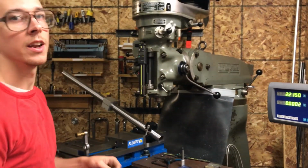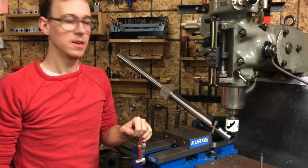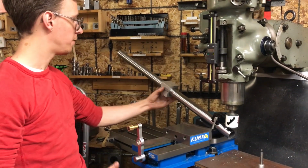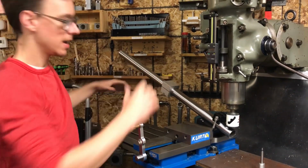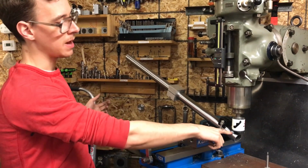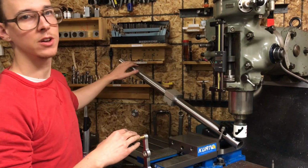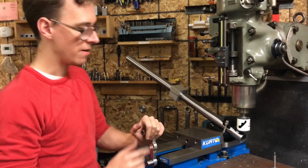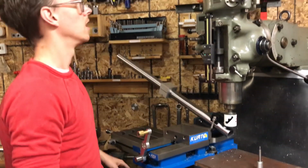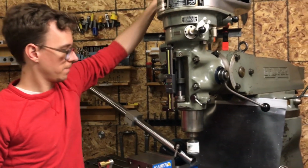We'll see if it gives us the right fit, but we'll start here and try it out. So I'm on the tube center line. I set the angle. I phase the tube this way, and I'm ready to make a cut. I'm up to my mark here. This first cut is not so critical on the length because I'm going to set the other cut according to the first one. My vise is tight. Well, now it is. And my table is locked down. That's what these are. So I'll take a cut.